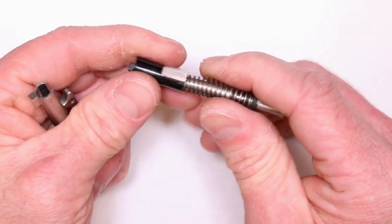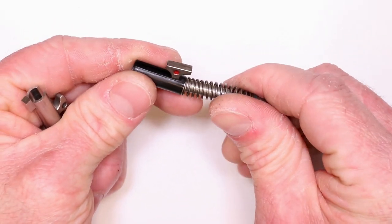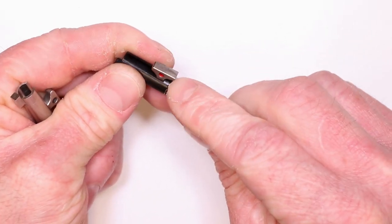The problem we experienced was the OEM plastic striker sleeve actually broke. The more you try to push this trigger pull reduction, the more likely you're going to have that striker sleeve actually break. The Achilles heel of this platform. Manufacturers — big ones — are going cheaper and cheaper to be price competitive. Internal parts that you may not typically see very often, at least when you're buying the pistol, they go cheap. Kills me.